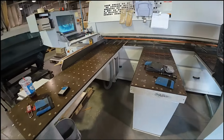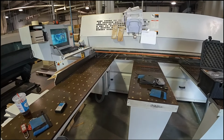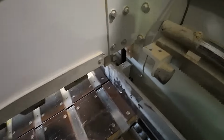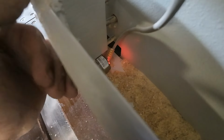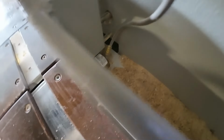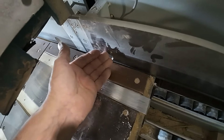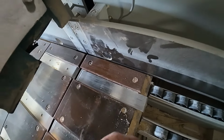All right, so I'm going to lock this out, climb up over the top of that, and get everything set. All right, so I've made the adjustment to this sensor. You see now the light is off. When I block this, the light comes on, off. No material, side aligner is disabled. Has material, side aligner is enabled. This adjustment, I brought this forward. Right now it's recessed back about 1 millimeter or so, maybe 1.5 millimeters. It's not very finite, because it really doesn't care.